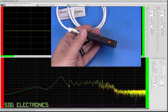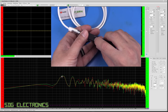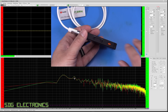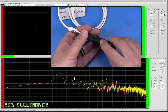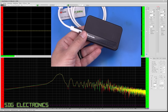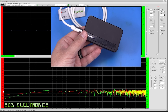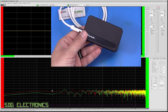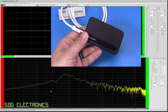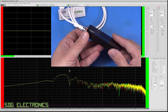We've also got two switches here: bass boost and gain. Putting the cursor near where we're peaking on the bass — turning the bass boost on, we get about a 6 or 7 dB increase in bass output. Then there's the gain switch, which I guess is broadband gain — there's a slight increase. The dynamic range seems to be a lot less than the Cambridge Audio DAC we repaired the other week. The noise floor is somewhere around minus 120 dB, and when we increase the volume it only peaks around 60. With the Cambridge Audio DAC, the peak was much higher. But I think we've got an effective repair here.